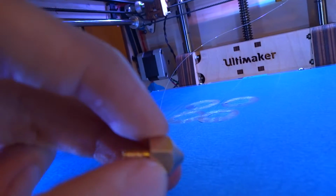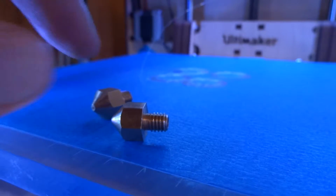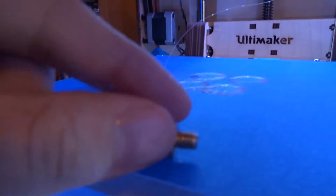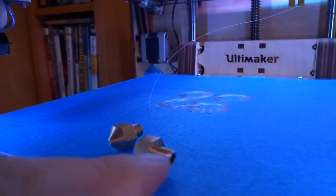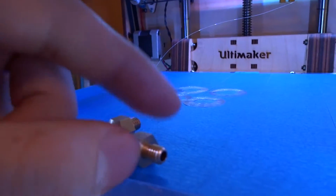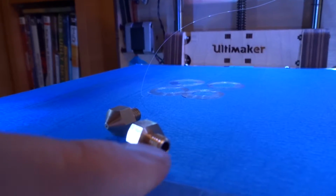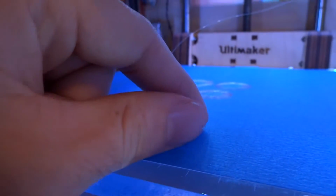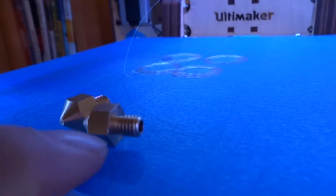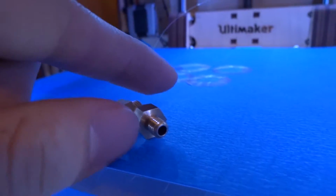And overall you can see that where they have done this slot for the end of the thread, they have used a sticking iron or whatever it's called, a stickler I think it's called. And you can also see that they are turning this a bit too fast. I mean, it's small, how can you turn it too fast? But either that, or their tools aren't really centered, because you get some interesting marks here, which you can't see on the camera very well, but there are some marks that tell me that the tool ain't centered when they are doing everything there.